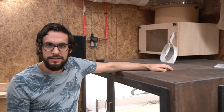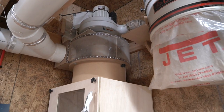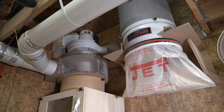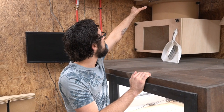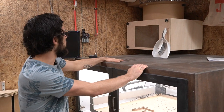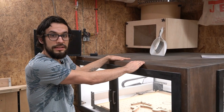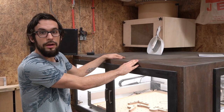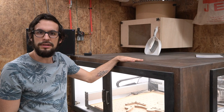The backbone of my entire shop is definitely my dust collector. It is a 2.5 horsepower Jet Vortex Cyclone dust collector that I've converted into a two-stage dust collector. I originally built it with a cylinder that was lower to separate all the chips out, but I had to reconfigure it when I built my CNC cabinet. It still separates chips pretty well and it does a really good job. So let's just follow this around the shop and take a look at a couple of the tools.